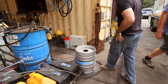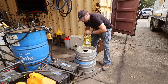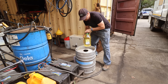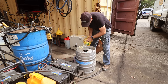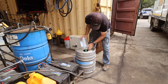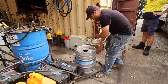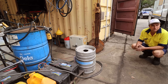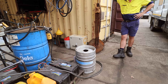There we go, first one - so there's four litres. Let's do a real robust mark because I don't know how much is going to show up. So every four litres - we've got four litre containers - every four litres we're putting a mark on a stick and that's our flow gauge. We don't have a flow gauge on this dyno, so we're doing an analogue gauge.